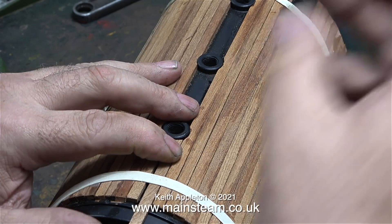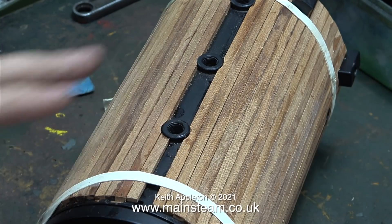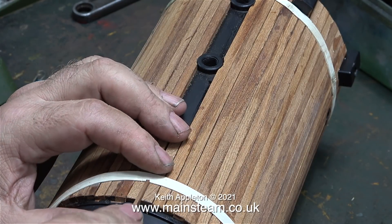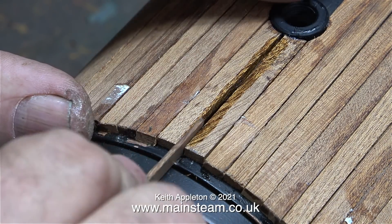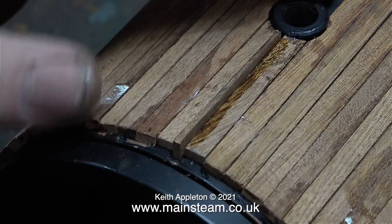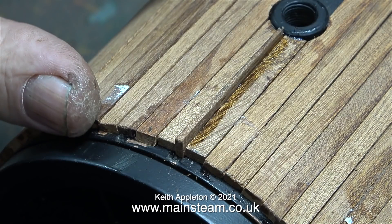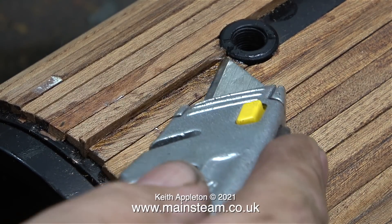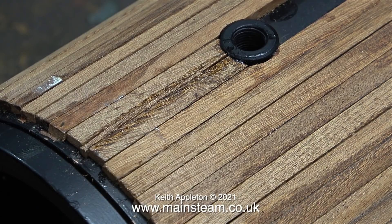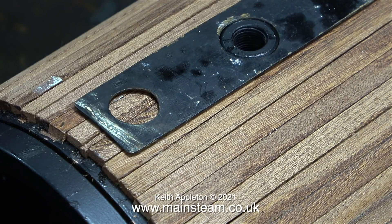When I fit the piece of mahogany strip on the other side, you can see there's a gap in the middle — this is a little bit odd. As before, once I shaped the end I marked it with a pencil, cut it off on the bandsaw, and then stuck it onto the boiler. I would just like to mention that if I wasn't going to fit the original strip of metal on the top I wouldn't have done it quite like this. I would have fitted the first piece of mahogany strip and then continued all the way around the boiler from the first piece of wood, not starting again at the other side of the bushes. I've made an infill piece which I had to shape on the belt sander, and now I'm cutting off the surplus.